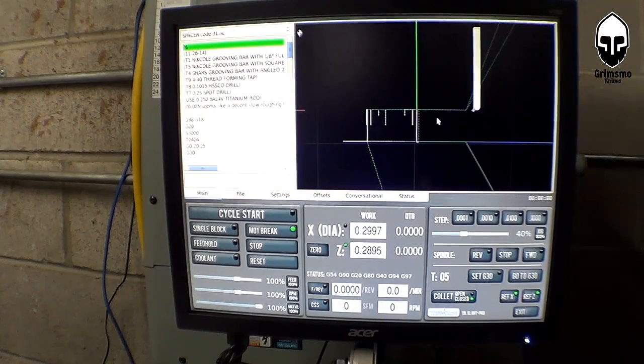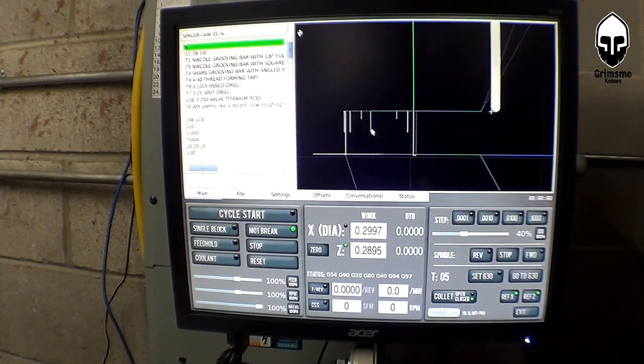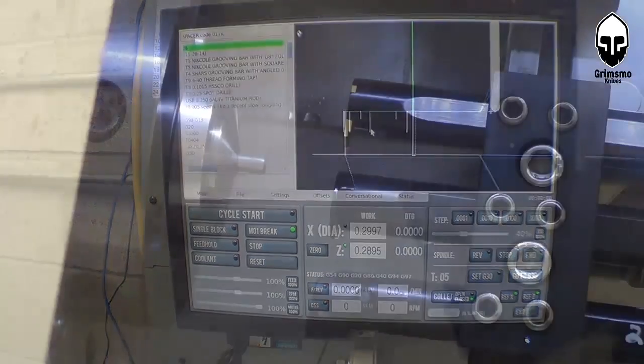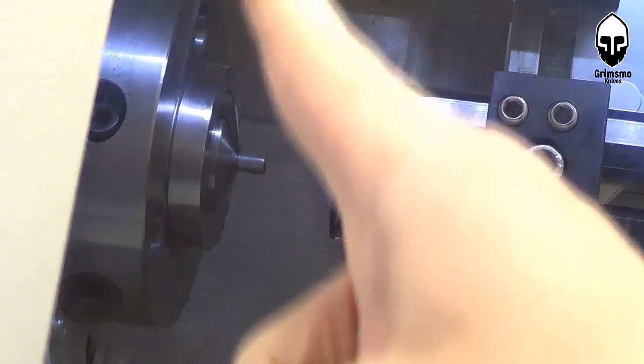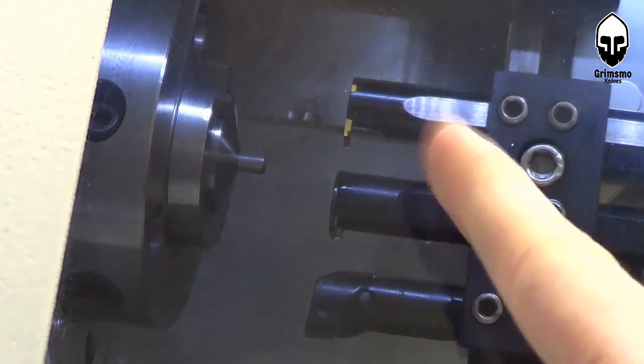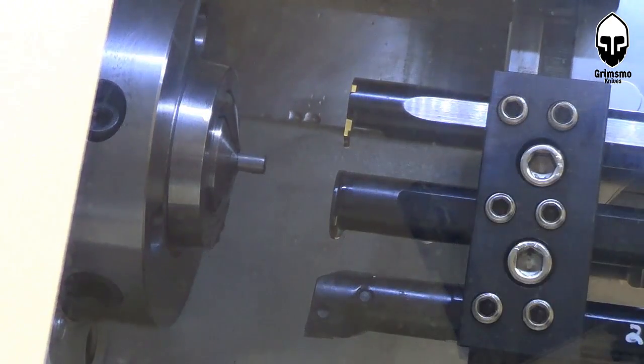Those are drills and a couple lines, and I'm not sure if all these make sense. They should make sense, so I'm going to try it out. I got the code all set up, I'm ready to go. I'm going to do an air cut first so I don't break anything due to a stupid mistake. I moved everything out one inch and then set zero for one inch away, so it shouldn't get any closer than that. It should have plenty of clearance and we can just watch it and see if it all works.